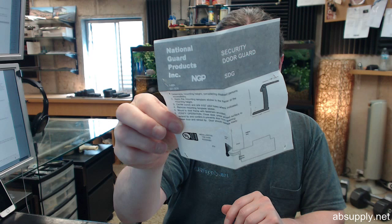Speaking of fire rating, this item is indeed fire rated: UL10B up to 90 minute and UL10C up to 3 hour for both of those classifications. Moving on to the installation instructions, which are certainly packaged with the material. There is a link below this video to the installation instructions that you can review pre and post purchase. There is a template included. Determine the mounting height considering a need for handicap compliance — if you are doing ADA compliant rooms, make sure this is installed at the proper ADA height.